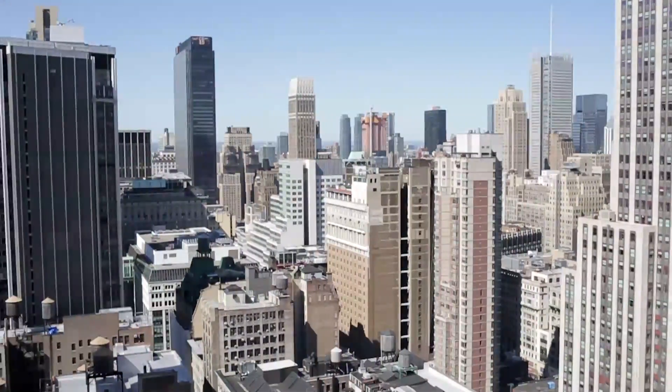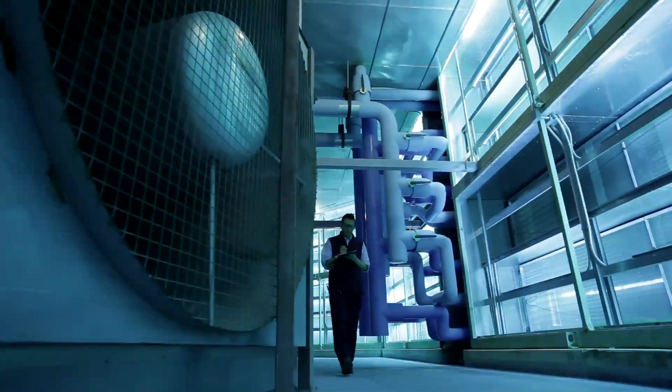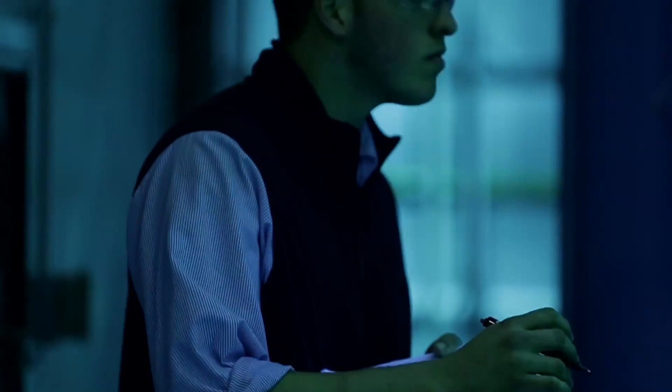You make sure you secure all your water on the outside of the building so you don't have freeze-ups. Things like cooling towers — there's a phrase called laying them up, so we lay up our cooling towers. The air conditioning in the summer is what we use those cooling towers for, and there's actually water running through them, so if we don't protect those in the winter, they'll freeze over and crack pipes. So we either drain down the system or make sure there's glycol in it to prevent freezing.